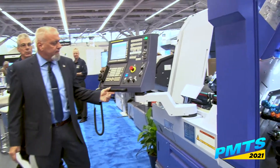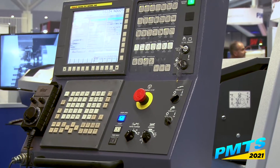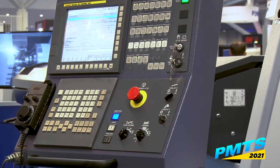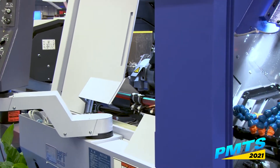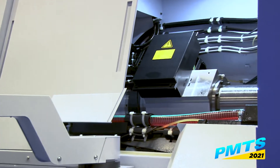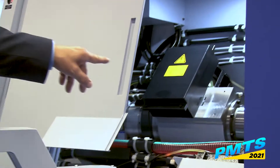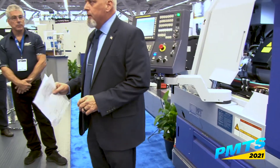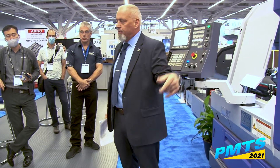With the FANUC 31i controller, it's a three-path control because this is a three-path machine — they can have three tools in the cut at the same time. We want to optimize any kind of process we put on this machine. We're starting with 12.6 inches of stroke, though that doesn't limit how long the part can be — with a Swiss, you can grab the bar as many times as you want and make up to a six-foot part. The front of the spindle has a ground surface that accommodates switching from a bushing to no bushing; you take the bushing out and that ground surface fills the area in the casting with the sealing ring.